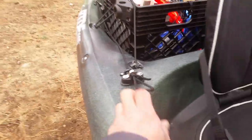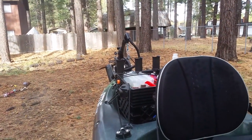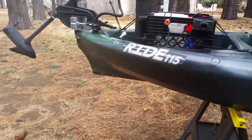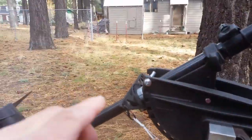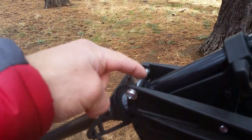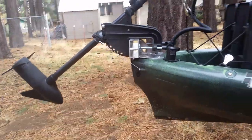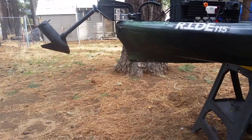When we pull that, we lock the motor up and it is out of the water. Because of the steering cables I couldn't allow it to go all the way up, so I used one of the holes provided by Minn Kota and put a bolt with a piece of vinyl tubing over it to make a soft stop at the length the steering cables can handle. As you can see, the motor is well out of the water and out of the way.